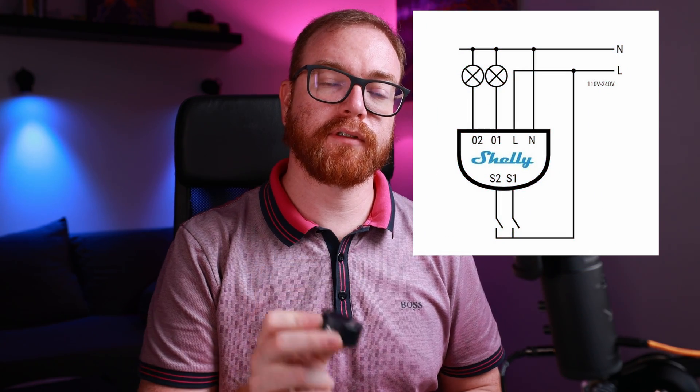The Shelly is a smart little switch that can be used fully local via HTTP requests to the device. It connects to Wi-Fi and communicates over the local network. Each Shelly basically has two different connections to various devices. It can emulate a light switch via HTTP request to turn on and off the relay, or it can connect to the actual physical light switch so that whoever uses the light switch doesn't even know they're operating a smart relay connected to Wi-Fi.